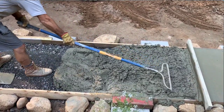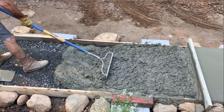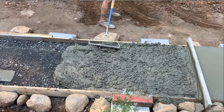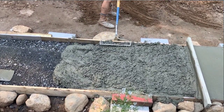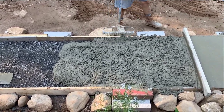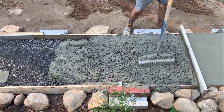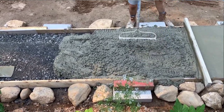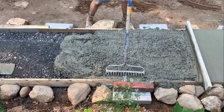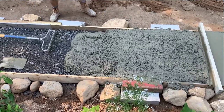You want to compact it down a little bit, push it down, and try to get the air out. It's going to take a couple of minutes to screed this. You'll be moving material around, screeding this way and that way, pushing it down, and take a hammer and tap the edges of the forms to get the air bubbles out and get the concrete to settle.